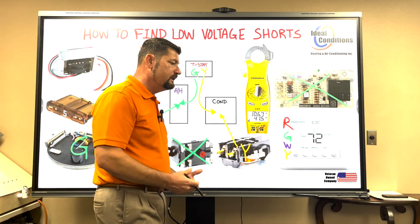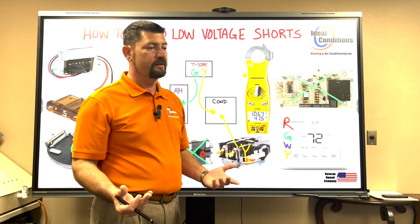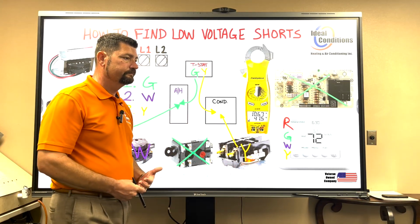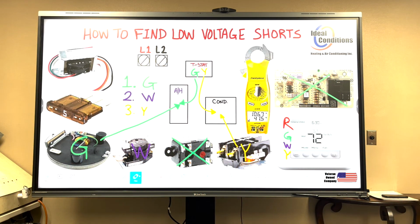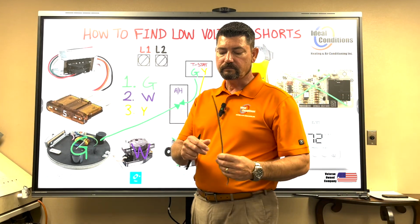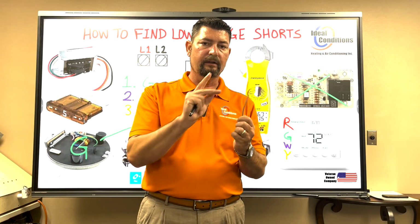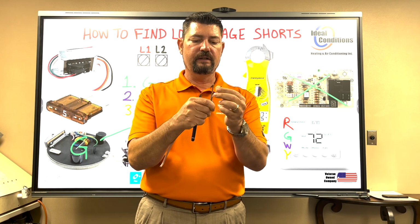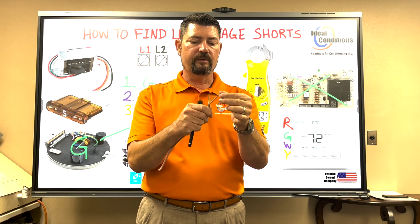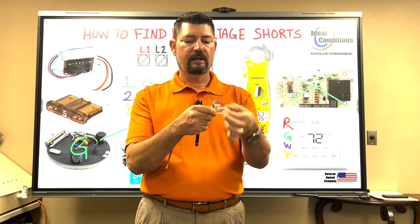There's very few thermostat wires, T-stat wires out there that have less than 8 conductors these days. I'm going to come off screen just a second to show you what I'm talking about here. Here's a low voltage wire. In this jacket, a weed eater can hit it outside as it comes out of the ground and goes into your condenser cabinet, and then it comes up into your cabinet, and you have all these conductors here, but really you're only using a couple. You're using yellow, most likely, and you're using blue for common.